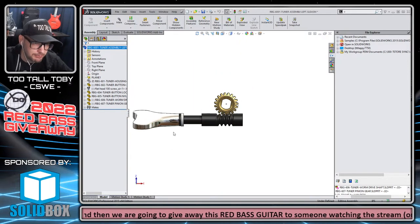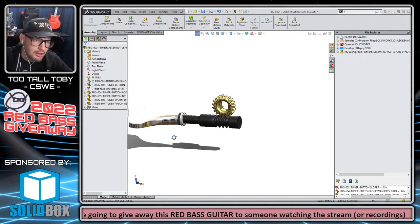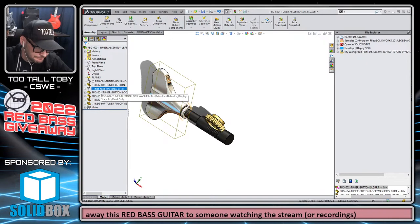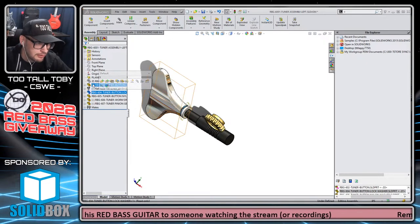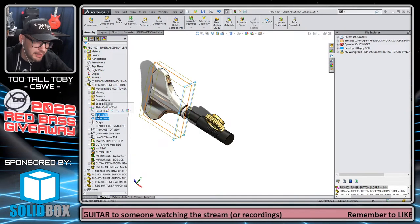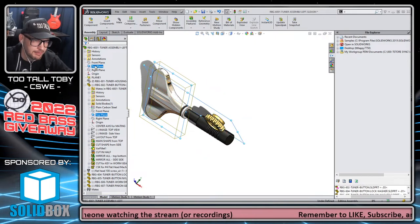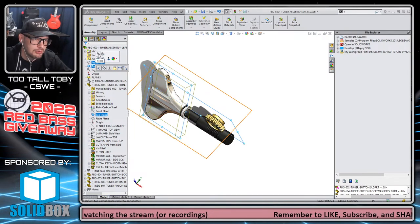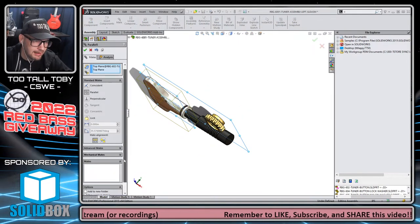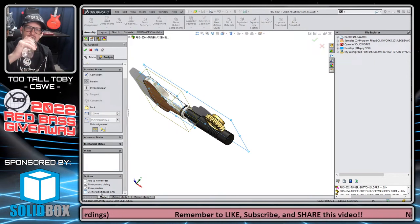So in the case of this model here, what I started out doing was moving this component into place. A cool trick that you can do in SolidWorks is you could take this tuner here and take its top plane, hold control, pick the top plane of the assembly, let go of control, and go to mate, and mate those two together parallel. But down here in options, there's this option that says use for positioning only.